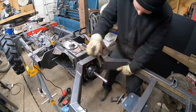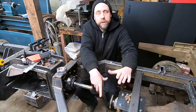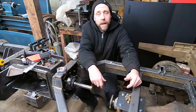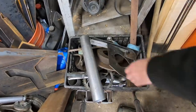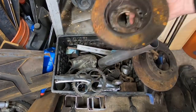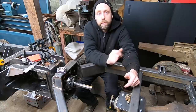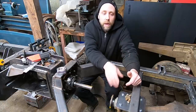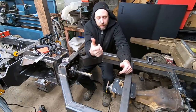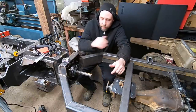All right, so I'm getting ready to make the short little drive line back here. And I was gonna draw up in Fusion 360 some 3/8 inch plate that I was gonna cut into a disc here, but I was digging around my scrap pile, I don't have any 3/8 plate. Remember, I have a bin over here with a bunch of old parts and pieces. I think I have some old discs in that. I'm gonna see if I can modify. The reason is I wanna have a center line rear parking brake on this thing. Manual for sure, and maybe hydraulic as well. I think I'm gonna get rid of the rear drums on the back and utilize just the front heavy duty discs up front there, and maybe tie this one in. So I'm gonna see if I can find those discs in there, modify that, and we're gonna start working on this drive line.